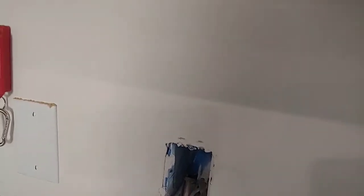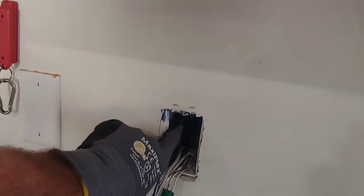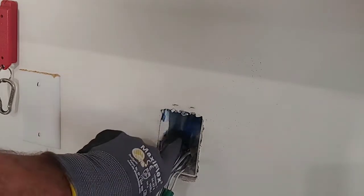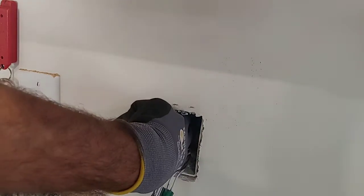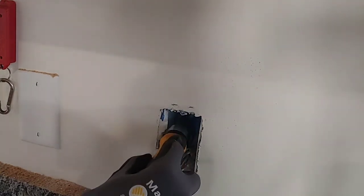We're in the middle of the building, under the wall. Now we're going to focus on the outlet. We've got the hole drilled up here into the wall, and then we're going to go into the box. There are two knockouts in the box — one on top on the left and one on the right. We're going to go with the left one; there are no wires coming through there. If you have a box with a ton of wires, it could be a little more difficult to snake a wire through. I'm going to go ahead and knock this one out using a flathead screwdriver, depending on what kind of box you have. The ones from Home Depot are blue and they just pop right out.